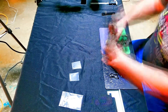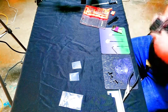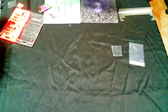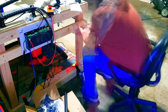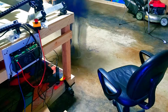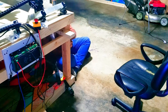I've been running my LongMill for just over a couple of months. I still feel I can fine-tune some of the eccentric nuts, and I'm having a tiny bit of an issue with Z depth, but I've adjusted it closer and closer to being right. Before cuts, I make sure all the feet and railing bolts are tight, and I clean all the rails, rods, and electronics of any dust or debris. I definitely need to get a dust collection system set up. I have the machine running with a Raspberry Pi 4 running CNCjs on a 10-inch touchscreen.